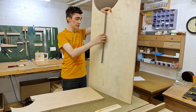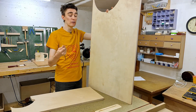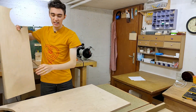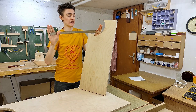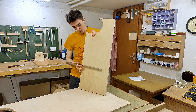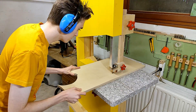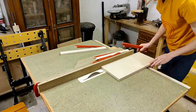Speaking of budget, I'm also pretty glad I purchased all the components necessary last year, since nowadays with inflation, you're not going to get even the most necessary parts for under $50. Looking at the stuff with the ruler, it turns out it's completely bent. You're never going to find a piece of any material that's totally flat, except this piece seems to be at least straight enough for me to use, and I really only need about 5 strips of 5cm in width and 50cm in length, equating to a rectangle of about 27x50-ish centimeters. Let's start cutting these parts, keeping in mind we still need to figure out which way around to use them to minimize the impact the slight bend has on the final printer.